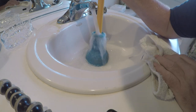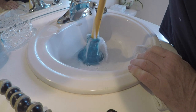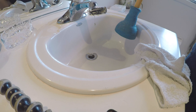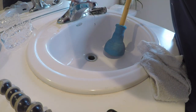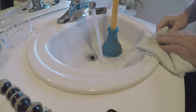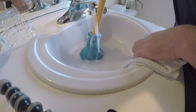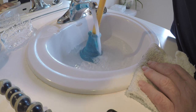For your drain line that's really clogged, this isn't clogged, but we'll find out in 1 second. If you have a clogged drain, not just at the sink level, in the drain line, it's going down perfect. So let's say your drain line is clogged and it still holds water with the pop-up out. This is when you'll gain maximum plunging power, when you cover the overflow hole. Sink's full of water. I'll show you in 1 second. We'll let it fill up. And using the water behind the plunger is the ultimate game changer in the plunging game.